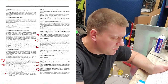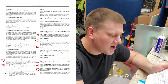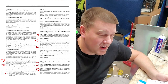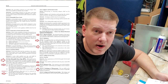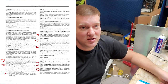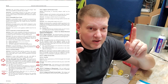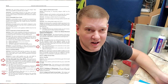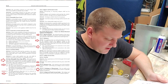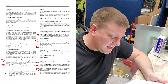The test should be performed with the power switch on and off. You have to test the device in both states — that means if it has fans, blowers, or compressors, you have to test electrical safety while those components are running. For something like a Jackson surgical table with linear actuators, you have to run both linear actuators and the tilt motor while doing your leakage checks, because one of them could be failing — and I've actually seen that.